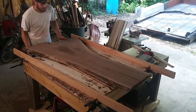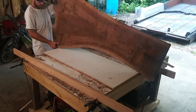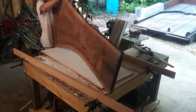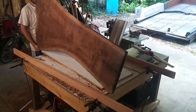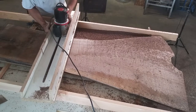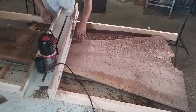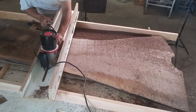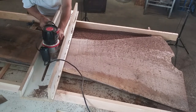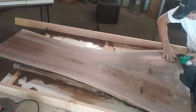You can see here I missed a spot on the top, and I did that intentionally — more on that later. Now I can work on the bottom side. After I got the bottom flat, I went ahead and sanded it off camera. Now you can see that I'm taping off the cracks to ensure I have a solid seal so that no epoxy will leak out.